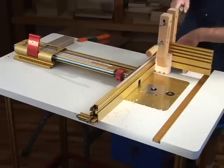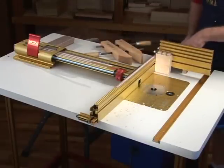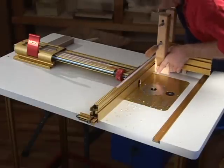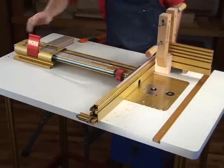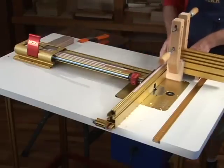After completing the cuts, clamp your right angle fixture to both fence and table, flip the stock, and re-clamp to the fixture with your wooden hand screw clamp. Now return the fence to a scoring pass and repeat the tail series of cuts.